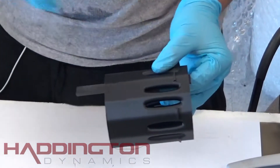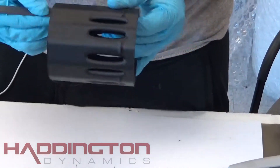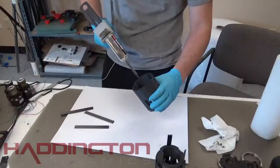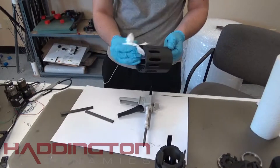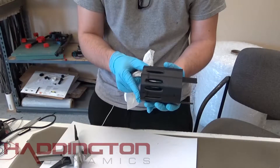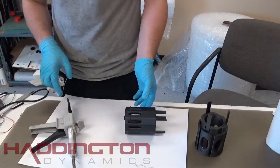Base light is a little bit different. The strakes are meant to stick out of the top by about a millimeter. This gives the code disk a place to rest when it's mounted. It is important to glue the strakes from the bottom so that the top can be wiped easily. Fill one of the holes from the bottom with some epoxy and then slide a strake in as you did before. Make sure it sticks out and then wipe all epoxy seepage. Skip a hole between each strake just as before and check the strakes again to make sure they didn't move. When they've been balanced, let it dry on its side so the strakes don't have any forces acting upon them.